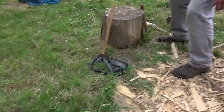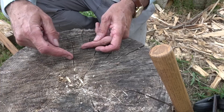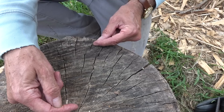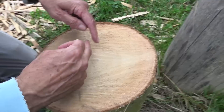The reason for that: if we look at this old log, you can see the cracks radiating outward. The log wants to shrink more in the tangential direction than radially, so the tension shows in these radial cracks. But if you can get your shingle from a radial wedge, you've got straight grain running across the shingle — it won't shrink much in width and more importantly it won't move.